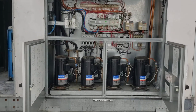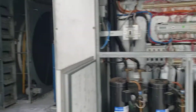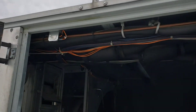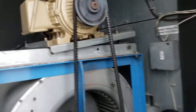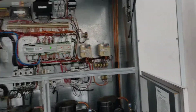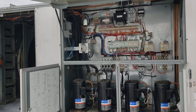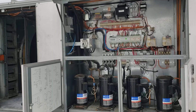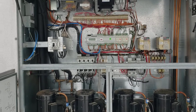I've been gone 16 months, so let me close all the panels — the unit won't run with the panels open. We've got safety switches on a lot of these critical doors that won't even power up. That's what it takes to keep the humidity out of the store and how you can have open-case refrigeration where you don't have doors and you can just reach in and grab stuff. It all works together — happy Friday, hope you enjoyed your quick nickel tour of the dehumidification unit.